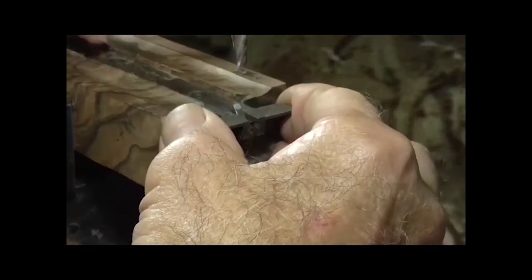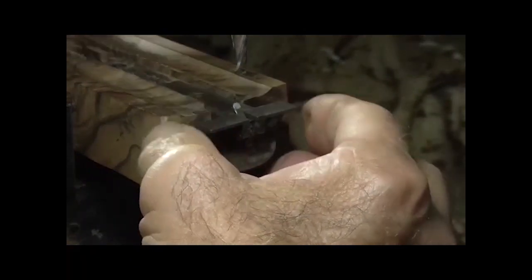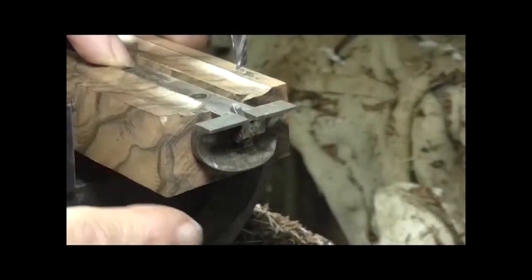The width is good — we'll see about the depth. And then I've got to notch out that crescent shape. I wish I had some kind of crescent-shaped bit to chew that out, but I just don't. I'm just going to have to cut it out with a bandsaw, rough it out, and then file it. I can file it and cut it with chisels.